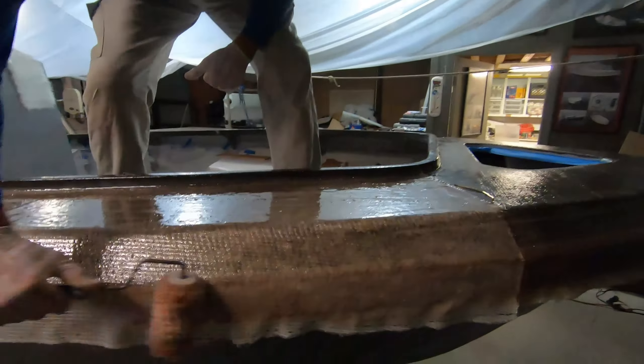Mark's rolling — you can see the difference. Look how transparent that is versus here where it's more opaque — that's going much darker. Mark, can you show them that little hard roller? These are little nylon ones — we call these bubble busters. That's a three-inch; Mark's got a six-inch. We'll put links in the description below, but if you're doing glass work, a fiberglass roller like this is going to be really important for quality glass work.